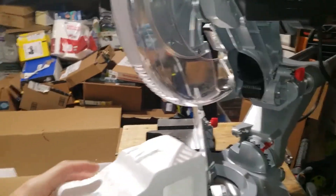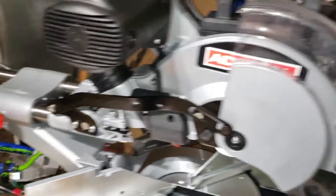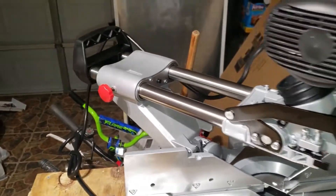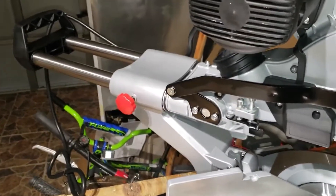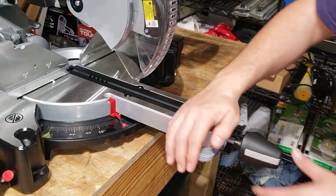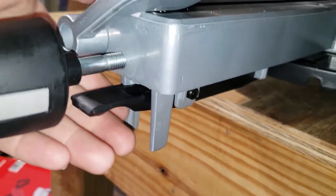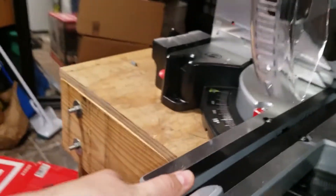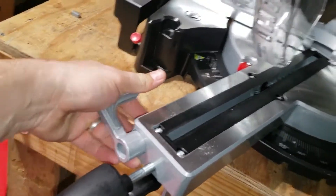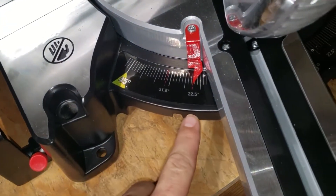Take out the styrofoam. You can use the red knob to lock it back and forth — when locked it stays in place, when unlocked it allows movement. If you want to angle the bevel of your cut, you pull this handle up and there's a little trigger on the bottom. Pull the trigger up and move it to wherever you want it to go, then lock it in place. It's super easy to get the degree cuts you'd like with a simple pull of the lever and the trigger.